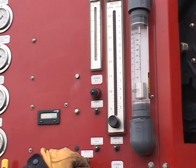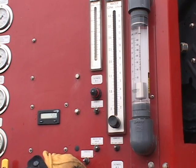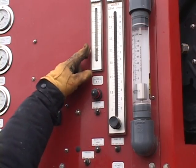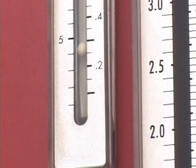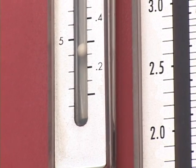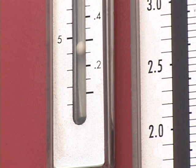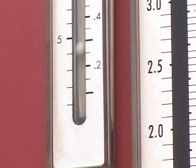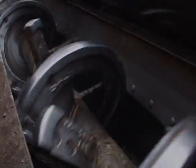What we're going to do now is inject 16 ounces of this diluted Plastihyde into one yard of concrete — that's what makes it so cost-efficient. We've got a ceramic ball, which is a very light ball. On this particular mix, we want five percent air, which puts us about four on the meter. This is all calibrated out through a calibration process, so when the mix starts it injects the exact amount of additive into the mix.